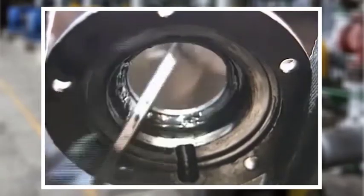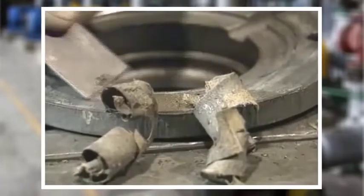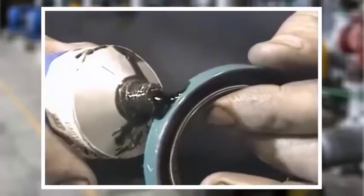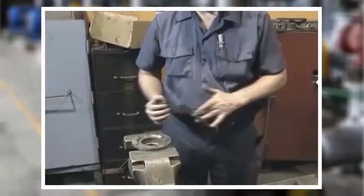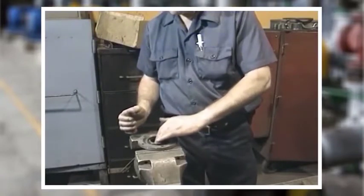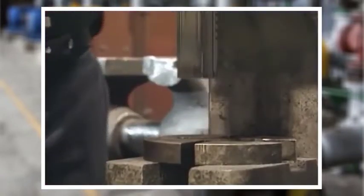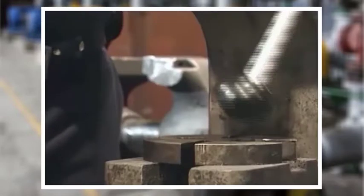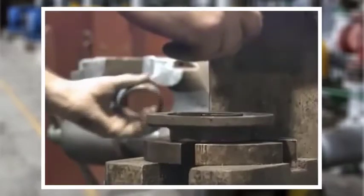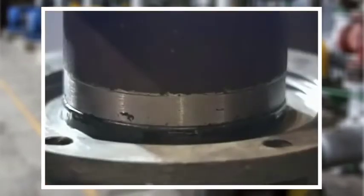Because the seal will probably leak, clean the seal cage thoroughly and remove any gasketing material. Some manufacturers specify a sealing compound for coating the seal prior to installation — follow the manufacturer's instructions. Then place the seal squarely in the seal cage with the garter spring on the side of the cage that will be toward the bearing.